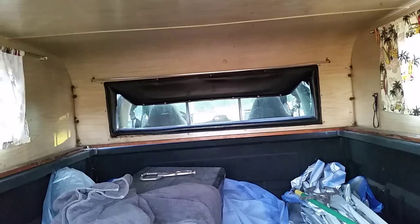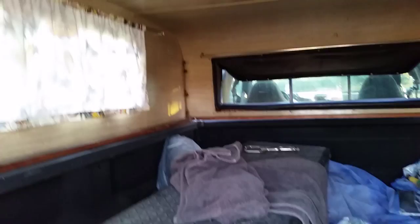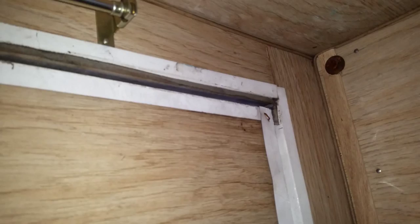It's pretty solid — I'm giving it a pretty good shake right now and can't get it to move. However, the old carpentry joints up here in this corner need attention; I'm going to add some L-brackets and punch out some stainless steel ones at work and put them there to reinforce that corner, and the same thing over here in this corner.